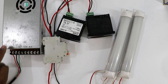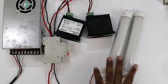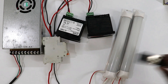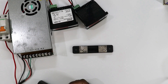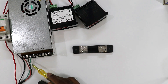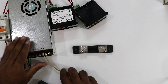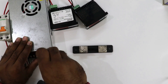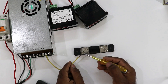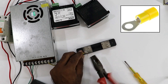I have already connected the input power supply to this SMPS. Now from the output terminal of the SMPS, take the power supply and connect it to the load. But since I have to measure current, I need to use a shunt. This SMPS converts AC power supply into DC. At the positive output terminal of the SMPS, connect a wire and take the other end to the input terminal of the shunt. Right now I am showing temporary connections, but whenever you do the actual connection use lugs.